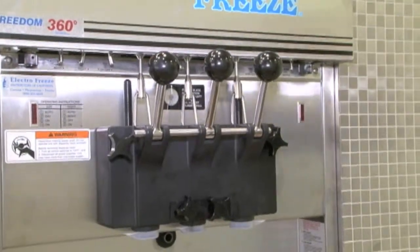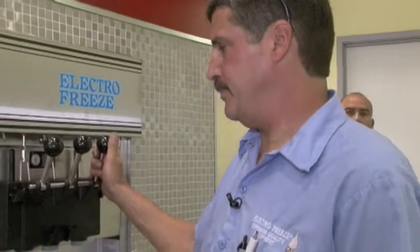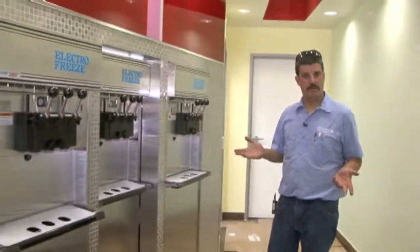The purpose of that lever is an optional force freeze, in case you were in a hurry in the morning when you started the machine or you had a very high draw. This is a self-serve operation, so you're not going to be using that often. You would also use it if it's a slow flavor and it's been sitting for a while — you may give it a little bump, about 30 seconds to a minute — and that will keep it frozen down. If the machine hasn't been used in a while and someone wants a taste, you could do that every so often during a slow period. Just a tad, maybe a minute or so, and that's going to kick it on and keep it a little bit more frozen.